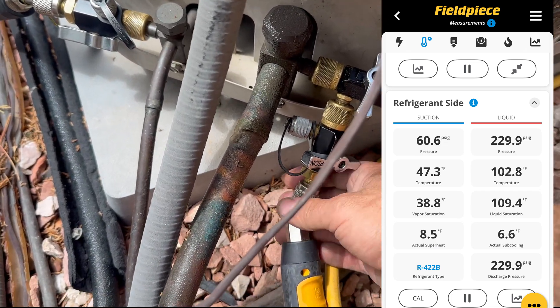Reinstalling the valve cores — the tenant is back up and cooling. About the repair: I'm not super proud of that at all. I would have loved to get below 500 microns at the very least, but the system's almost 30 years old, it's been gauged up probably 200 times, and I just don't have time to fix it right. I'm recommending replacement on that evap coil because I don't even know how long my repair is going to hold. Hopefully it holds for the rest of the summer — we'll see. Thanks for watching; see you on the next one.